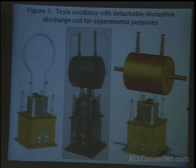So the power would come into this through the front, and there were some short-circuiting bars, much like industrial control transformers have, where you just put the windings in series or parallel, depending if it was 110 or 220. And this was wired up to the series of induction coils here. Now, these were either in series or in parallel, depending on the supply voltage.